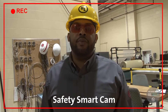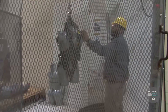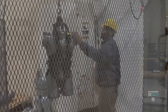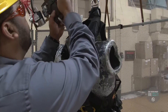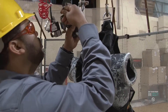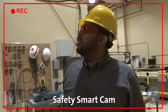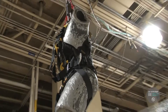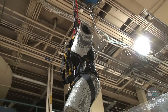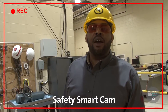Can you explain how you put this all together? How we put this together is we'll dress this torso in a full body harness to a snug fit, meaning we'll tighten up all the straps to make sure the harness is very tight on this torso. We'll then attach the attachment points where we want this harness to fall from, raise it up to a particular height, and press the quick release mechanism to allow the torso to free fall. We want to ensure that the torso does not make contact with the ground.